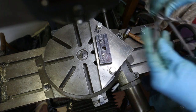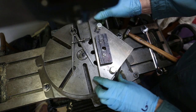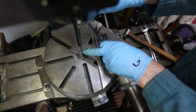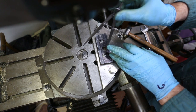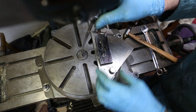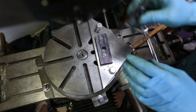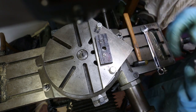I've set my dividers to 67.79mm, or as best as I can get it. The two fixture bolts are done up finger tight, and now I'm measuring between the centre dot in the end of the bolt — which I know is in the centre of that hole — to the centre of the rotary table. That one's pretty good, but this one is not so good; it's too close. So I need to tap it away with a little hammer, check the distance again, and we're getting close. Once I get that set I'll tighten the bolts just a little with a 17mm spanner and move on to the next stage.